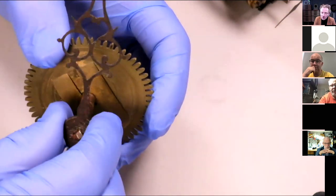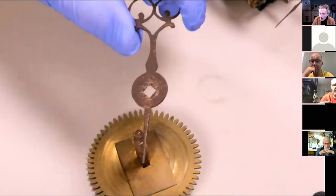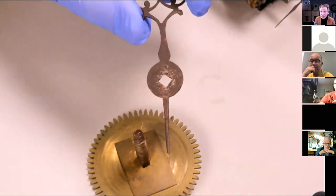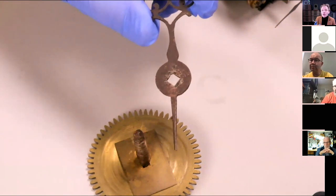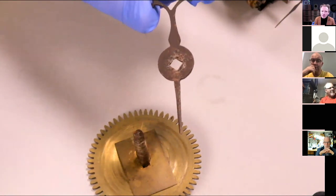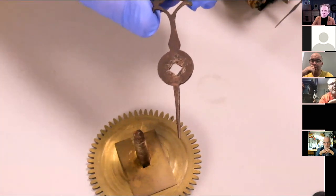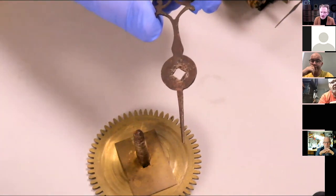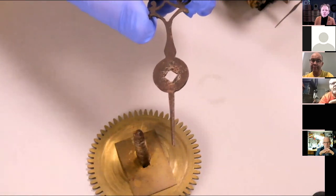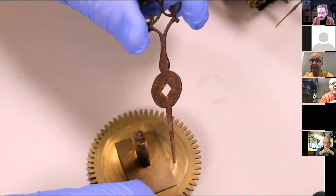So my first point, I don't have a long case clock here, but they're basically the same. Whether or not it's a square hole here for the hour hand, sometimes on 17th century work, that's actually pentagonal or hexagonal or octagonal, like lots of clockmakers showing off skills. But they fit on in one direction. So it's worth looking at those marks. And they're often there to find out originally where the hand fitted. And it might be that you don't want to put it back where it was originally because all sorts of alterations might have taken place. But it will get you somewhere.